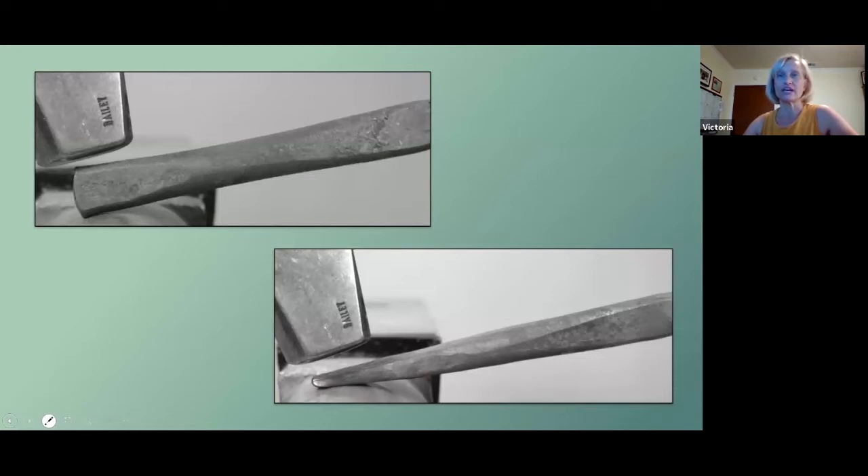Note that in this case the indexing is perpendicular to the finished edge. When you go to use this slot punch, your material is going to be on a long bar with you holding on to it facing you, so the indexing perpendicular to the slot punch edge is going to be important.